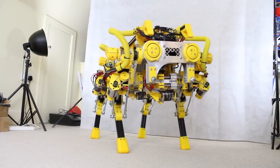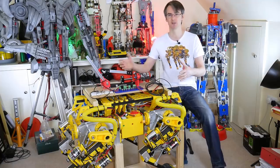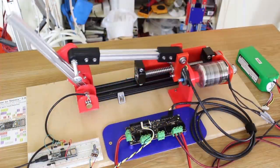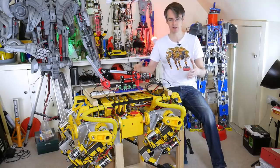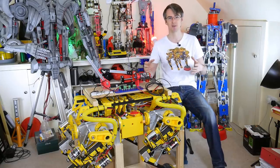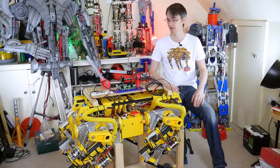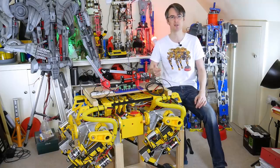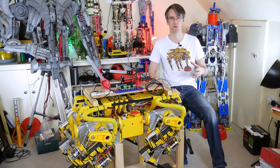There's a lot of things that are going to happen and I'm showing all the detail. We started this in the last video. Last time we made this test rig and I was looking at putting absolute position feedback on the joints, so that on power up we can recover from an unknown position and also in between flashing code on the master controller we don't lose those end switches. At the moment we home every actuator to an end switch, and the motor drivers can't remember that position. So this time we're going to look at some better quality pots and also some digital feedback encoders and have a bit of a discussion about the way forward.